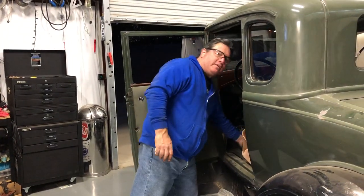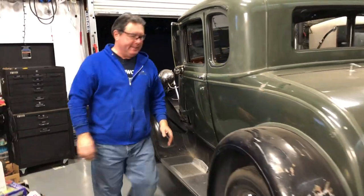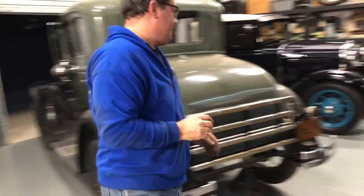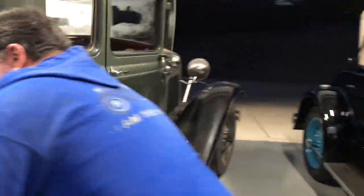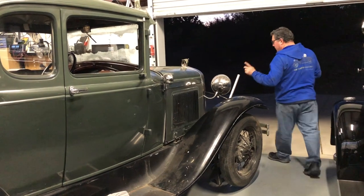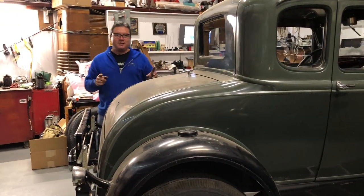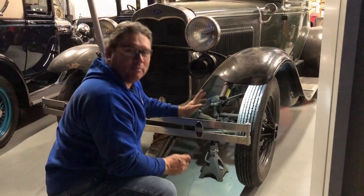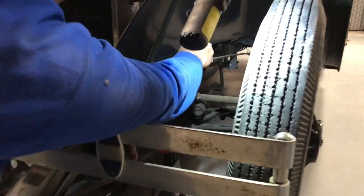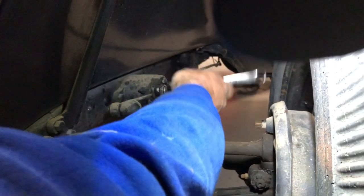Just about finished with the brake adjustment. I've got my brake adjuster tool on position number two now, so everything should be pretty tight and they should be equal. That one's pretty tight, that one's pretty tight, that one's pretty tight, and that one's pretty tight. They're all equally tight. Now I'm going to go around and make sure all the jam nuts are tight against the clevises on all the rods, and then the brake adjustment is done and this thing is ready to stop. With the brakes all adjusted, I'll go ahead and tighten up all the jam nuts, and once those are tight against all the clevises, I'll put brand new cotter pins on everything. Brake adjustment complete.